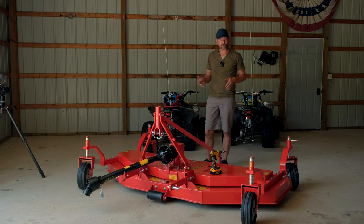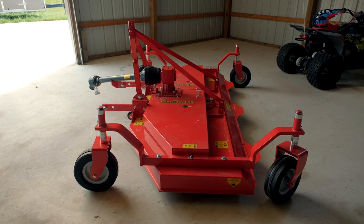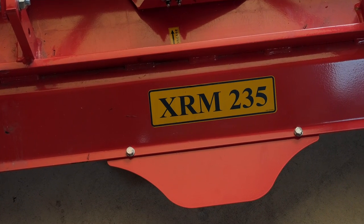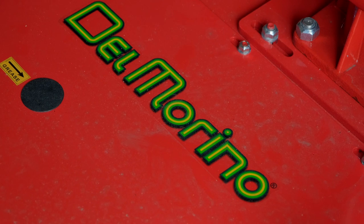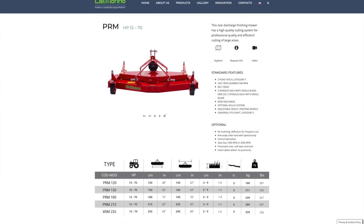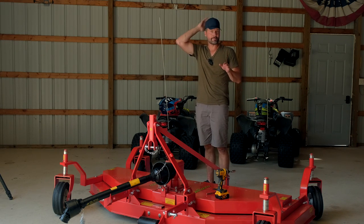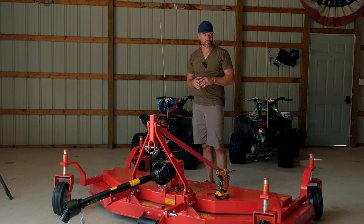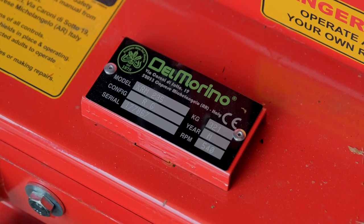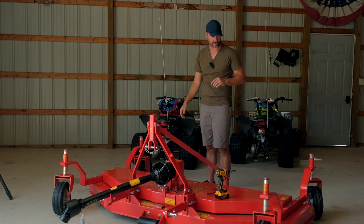You're looking at a pretty much fully assembled XRM 235. This is a nominal eight-foot wide — the 235 I'm pretty sure is centimeters, and converted to inches it's about 93 inches or so, maybe a hair narrower than eight foot. It's rated to work on 12 to 70 horsepower tractors — that's quite a range. It must not draw a ton of power off the PTO to operate. My bigger concern, rather than the PTO, is the lift capacity on the 1025R — it weighs 705 pounds plus gear oil. We're going to see if it can do it; otherwise we'll run it on the 3025E.